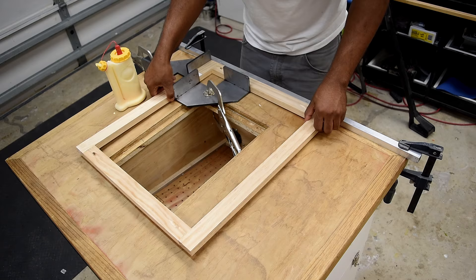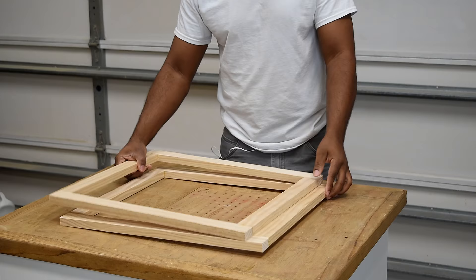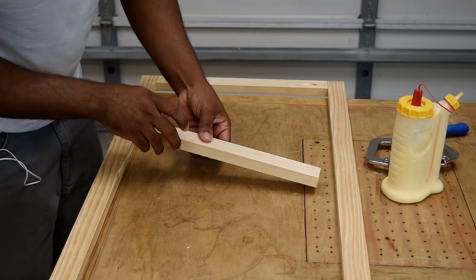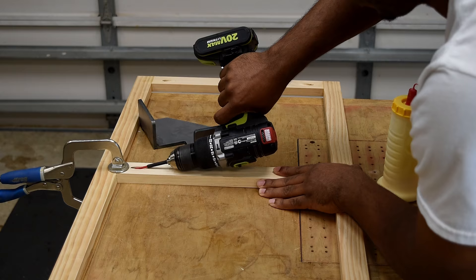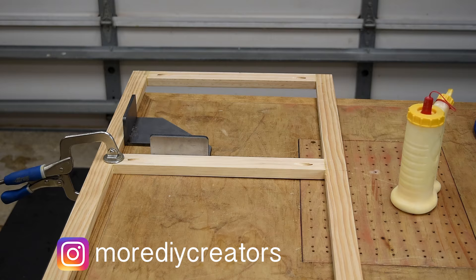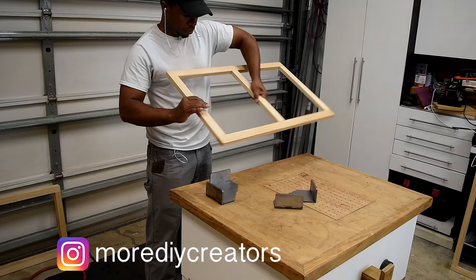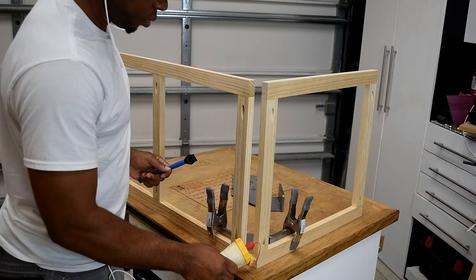Once I got the first one done, I repeated the same process to duplicate everything else. I ended up with two outside trims, two sides, a top, a back, and a front. There's also a piece I'm going to attach to the back for structural support. Some metal squares a buddy of mine sent me via Instagram really came in handy — I'll put a link in the video description. Now it's time to assemble the frames; I'll square these up first and make sure the pocket holes are facing out.